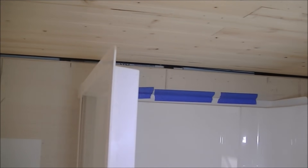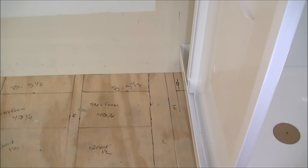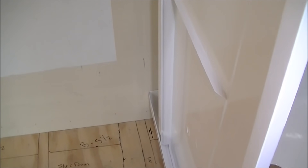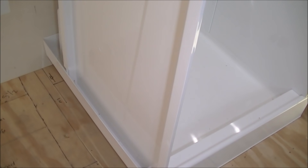We'll be building a wall on each side and figuring out ways to anchor the back of the shower to the back wall. This wall on this side is going to end up being roughly about five inches thick and we're going to mount our shower faucet apparatus on this wall. I'm figuring out a way to make this wall where it's got a passway on the inside so the plumbing can come through and turn up to the connections at the back right here.